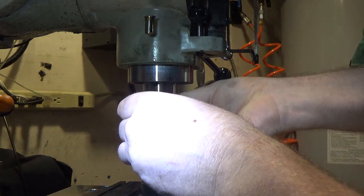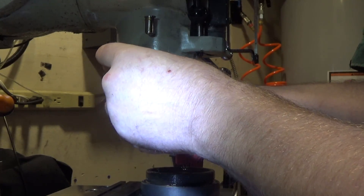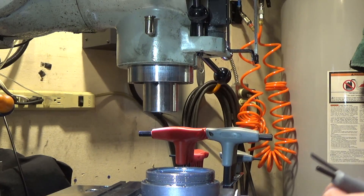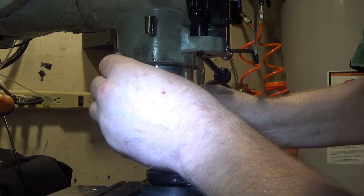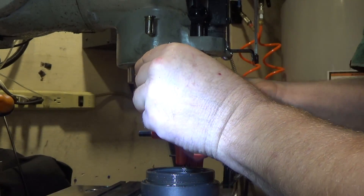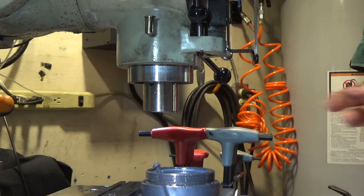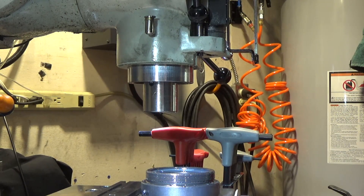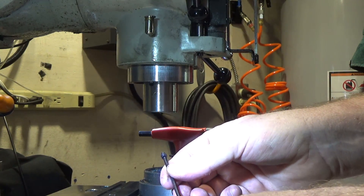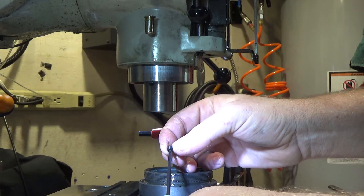Once you've done that, pop in the backing screw. In my case, tightening the backing screw was also rotating the front set screw. So I'm going to apply some removable Loctite on the slot alignment pin set screw because there's too much slop and the backing screw is making it rotate. That way I won't get a collet stuck or be unable to get a collet in and have to take the whole thing apart in a hurry.